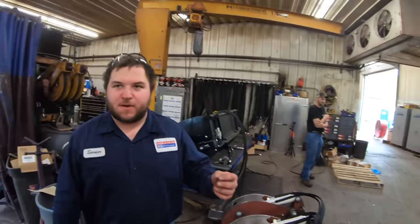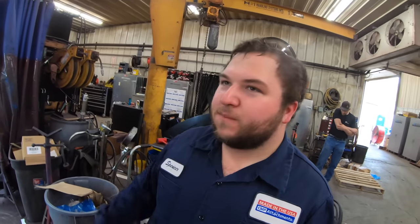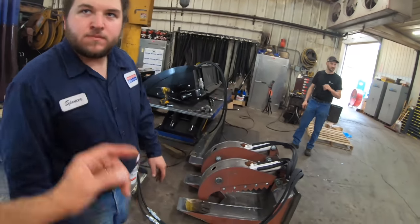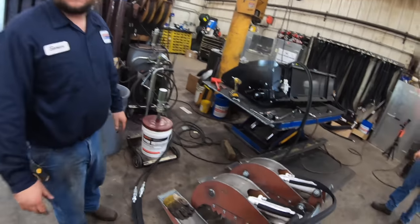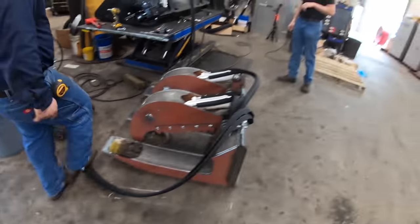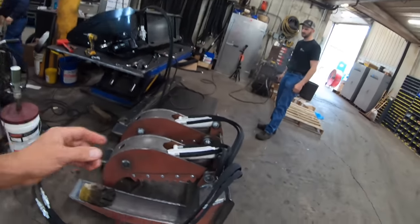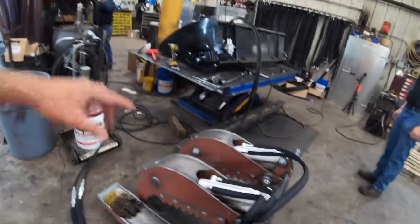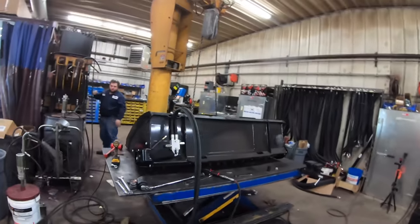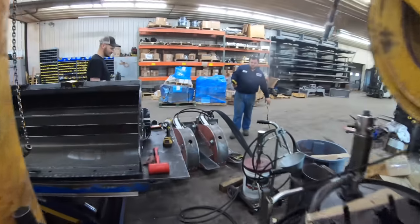On the hoses, there's a bunch of debris that gets inside the hoses. Gigantic filter, so that when you put it on your machine, it's already clean. Oh, okay, so you're filtering it right now. Yep. So, filter and test. This will leak check it. We're gonna take all the hydraulic fluid, all the contaminants that may have gotten into that cylinder, and it's going into a giant filter over here. And we'll see if it's gonna work. Here we go.